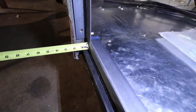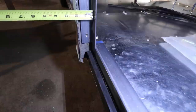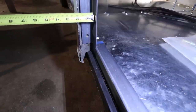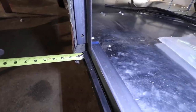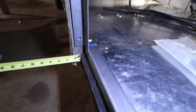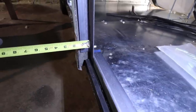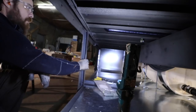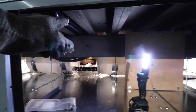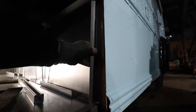Looking at this edge, I was a little concerned that the distance from the front edge of the skin was about one and three quarters, but our square tube is only one inch. Keep in mind that the weather stripping shouldn't compress too much — when the door just barely touches it at one inch, and with the slam latch installed it'll compress just a little bit more, which should be perfect. The measurements are going to work out great. The next piece — we've got the bottom and sides done and we need a top header piece.